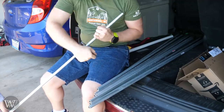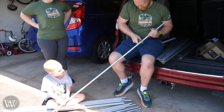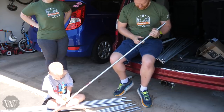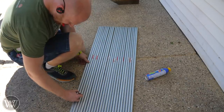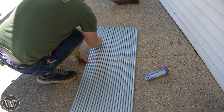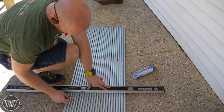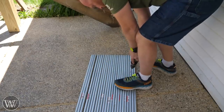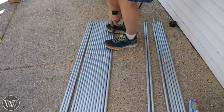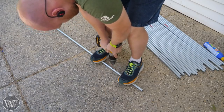Now we're going to move on to the awning that will go underneath this. For this I need a whole bunch of ¾-inch conduit pipes cut to length — these will be what hold the awning up in place. We're going to cut these all to length and bring the kids in to help. I need to mount them so there will be screw holes that need to go through in pairs, so I'm going to lay them all out and make a mark on top of every piece. I'm drilling a ⅛-inch hole — this will be what the screws can drive into. Even though I'm using self-tapping screws, drilling the hole first makes it much easier for the screws to catch.